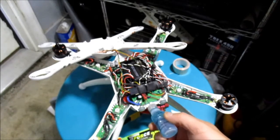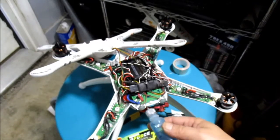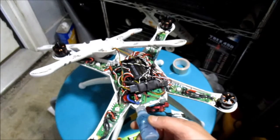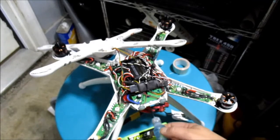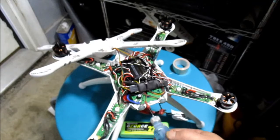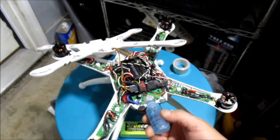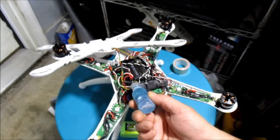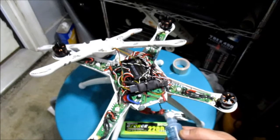Right underneath here is the power management — the power sensor. I unsoldered all the 12-gauge wires, put 14-gauge wires on it, soldered it to the board, and then soldered the regular battery connector. The LEDs are just constant on green. I soldered a 100-ohm resistor on the ground side, put a servo connector on it, and used one of the extra slots — that way it's just providing 5 volts and the LED stays on constant.